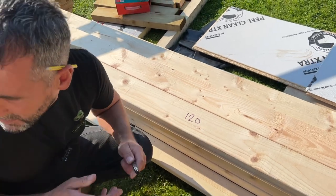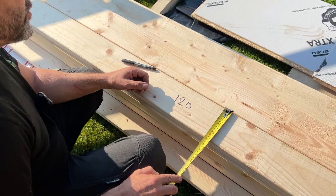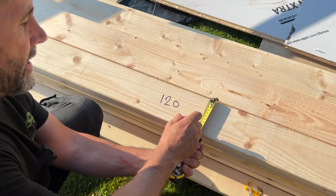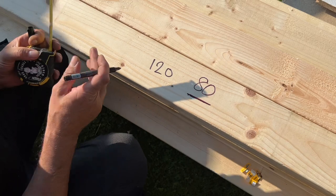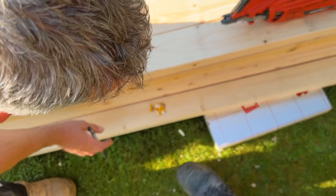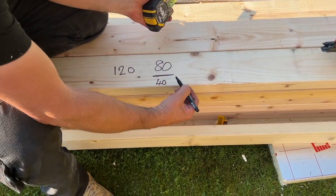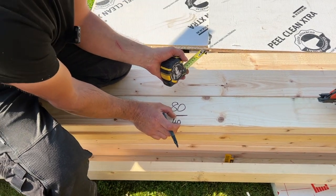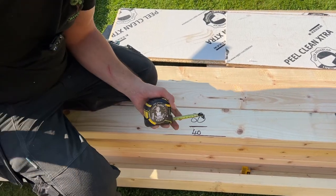The C16 finishes at 120mm, and as luck would have it our steel is 80mm. So the steel will sit on top — that's 80mm — and the remainder is 40mm. The 4x2 finishes at 38mm, which is 2mm less, so by the time we've got our steel on and the timber in place for the upside-down joist hangers, there's only a 2mm difference — absolutely nothing. The plaster walls will go over that.